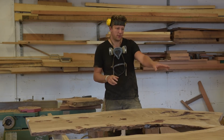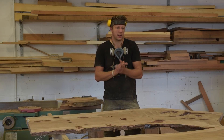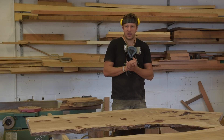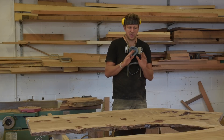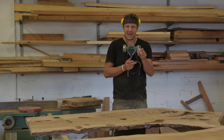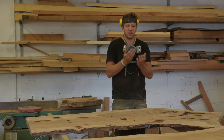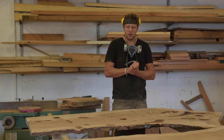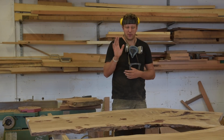We've got the middle piece here almost ready for finish — I'm just doing the final sand on it. I can't wait to put a coat of polyurethane, it's called the good stuff made by Emmet's Wood or something like that. It's a really nice finish, super satin, just brings out the color of the wood beautifully. What I found worked really well was the Tyvek tuck tape type stuff — it sticks really good and sealed up all the undersides of my beams so I didn't get any drip through hardly at all. I recommend using that Tyvek tape because it worked way better than the masking tape for me.